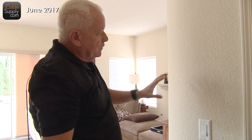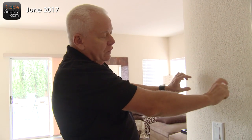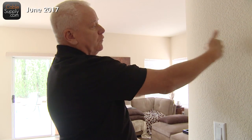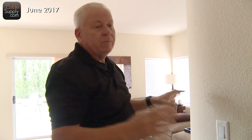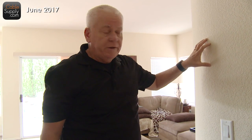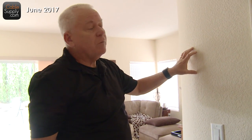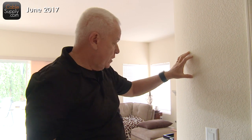Sometimes we drill through those fire breaks when putting cable through, and you can do that. You can drill through that little panel, and you can also drill through the studs. It's just that you don't want to weaken the studs and make really big holes. To make a long story short, it makes this wall almost impossible to cable without drywall damage.